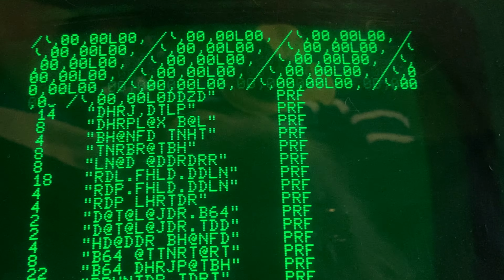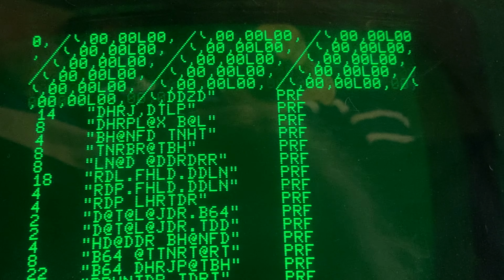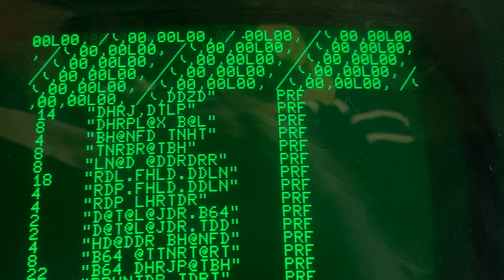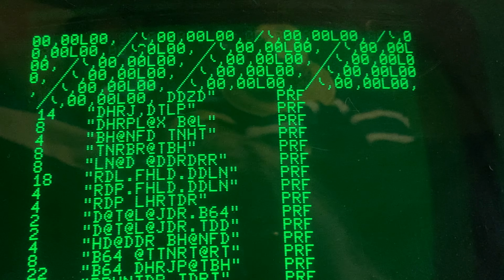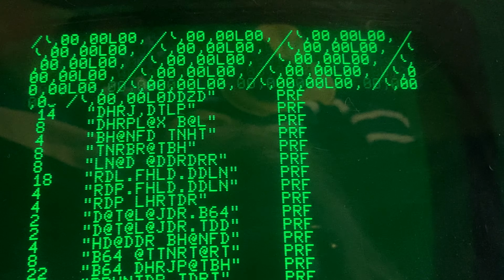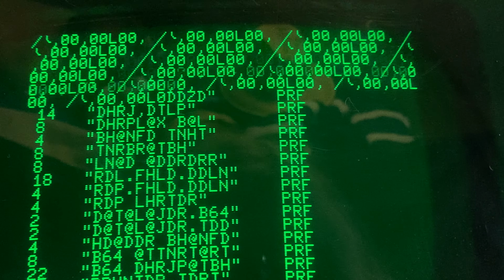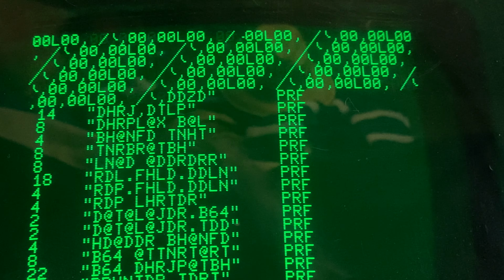I believe what's probably about to happen is that this board is going to come out, and there are two 6522 chips. And I am not sure which would be the one, because they handle input-output things, and I'm not sure which one does which. But there are two of them. So I'm thinking one of them has suffered a subtle failure, producing this squirrelly result.